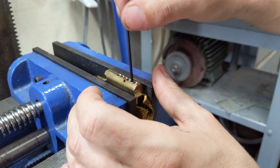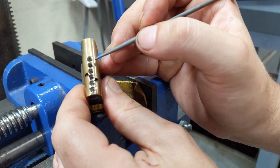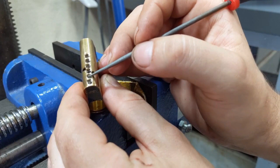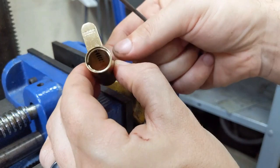We're going to show two things — I made a couple mistakes and here's how deep I tapped the holes. You'll notice that holes six, five, four, and three look like they're the correct depth, but holes one and two did not go as deep. To correct that, take the screw out, put your tap back in there, and cut a few more threads. And now you have a fancy grub-screwed ASSA Twin Combi core.